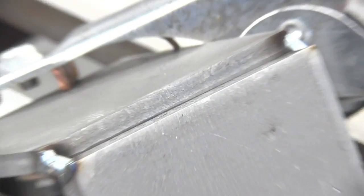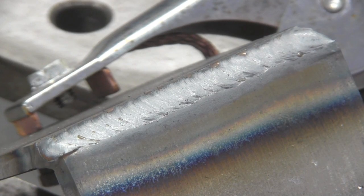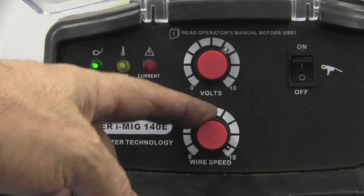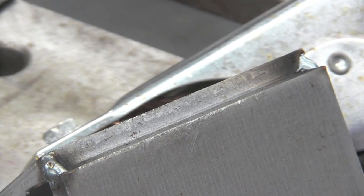So that's eighth-inch thick going downhill. Eighth-inch thick is about the cutoff for me as far as going downhill. I left the settings the same for this quarter-inch outside corner joint — settings for eighth-inch thick — and you can see it's not exactly hot. It's going to look okay, but it's not exactly getting down into the bottom of that root where we'd like it to. But just for kicks I left it the same just to see how it would weld. Not too bad, but now we're going to crank it up — wire feed speed up to about 90 percent — and adjust the voltage on a piece of scrap until we get it welding smooth, then weld another outside corner joint on the same quarter-inch thick steel.